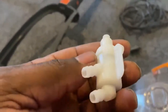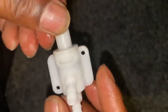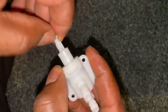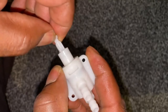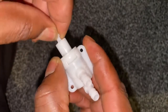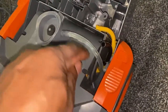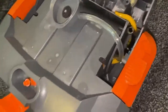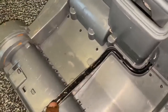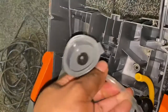This is the actual actuator that controls the fluid — when you press the handle it lets the fluid through. If it's up like this you can blow through one hole; if it's down like this you can blow through the other, and it locks one of the holes off. Inside there's a pump that pumps fluid into the machine — it pumps out into the yellow pipe first, and when you pull the lever it goes to the black pipe and feeds the cleaning fluid.